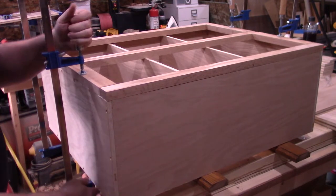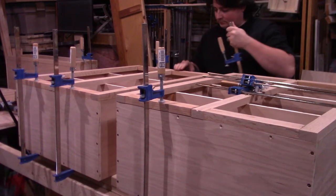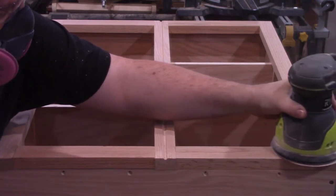For the bigger face frames, I enlisted corner clamps and a long skinny drill bit to pre-drill the long sides a little bit to prevent the pocket hole screws from cracking them. The next day after the face frames were assembled, I applied some glue to the perimeter of the cabinet, dropped the face frame into place, pulled, twisted, and aligned it to the cabinet, then pinned it into place and clamped it down. Going this way with all three was probably my least stressful glue-up to date — definitely having PTSD flashbacks to the butcher block countertop I tried to make.